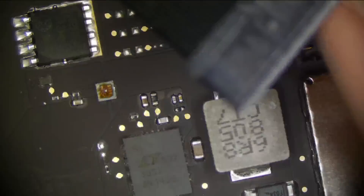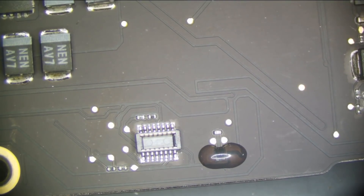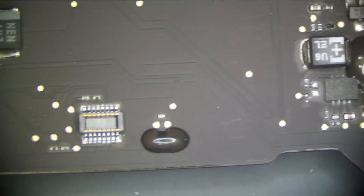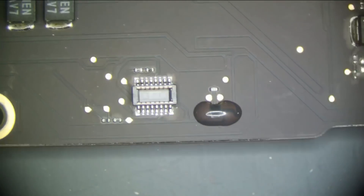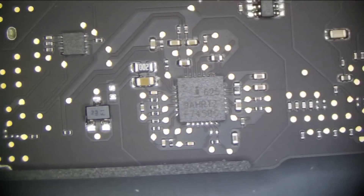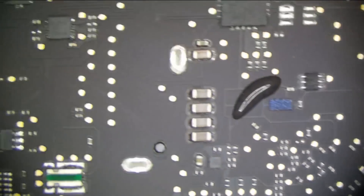One thing to note is there is a really, really lousy aftermarket battery installed in the machine. Without using our brain, let's just go ahead and look over the board under the microscope. We'll go over our common areas such as our JTAG connector, our clock circuit, as well as U1950 — so far everything is looking really good. The ISL looks nice and clean, no corrosion by the SMC.